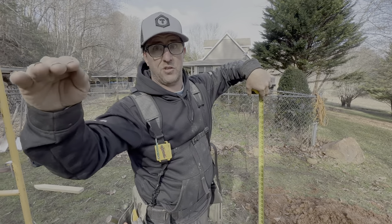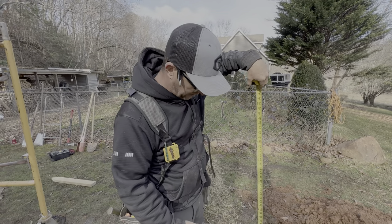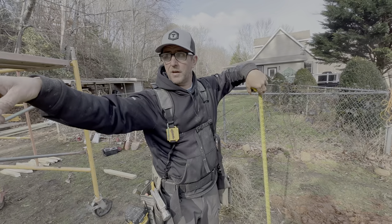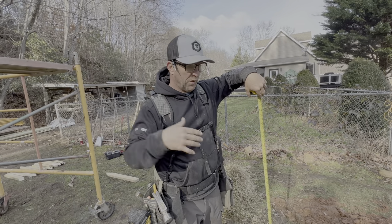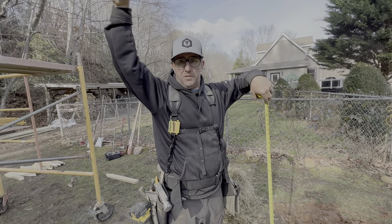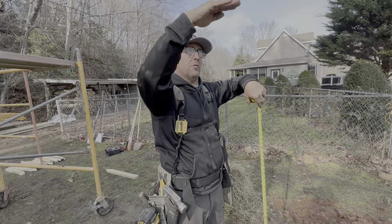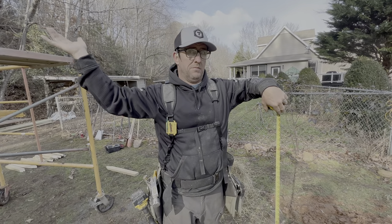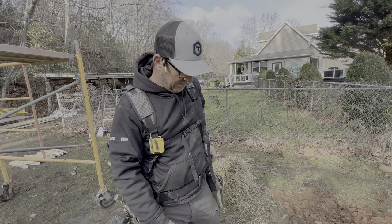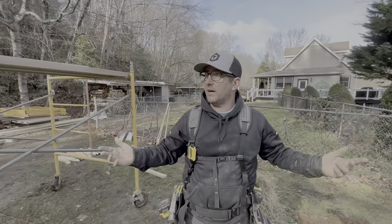We're using the same laser line for the shorter posts. These holes are dug down deep, so I took my measurement up to the laser line and subtracted it from 52 — on this one it was 22 and a half. We added that to the post length to give us the top of these posts. But these posts are three foot shorter, so all we did is subtract three foot from that, and that gives us the top of these posts three foot down from the tall ones. It's a lot of math, and math doesn't lie — thank god Jones is the math guy.